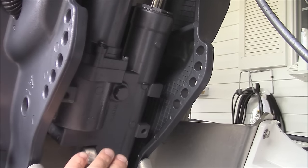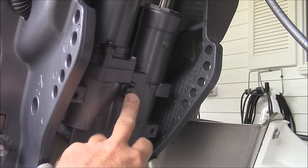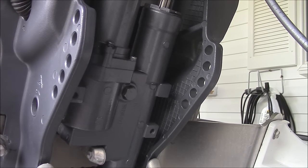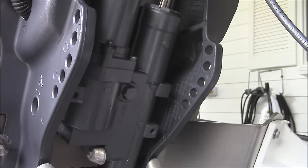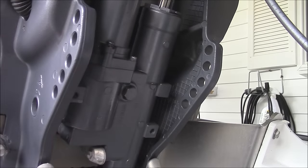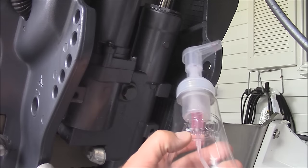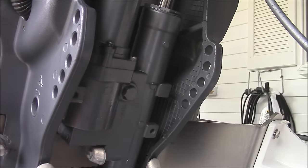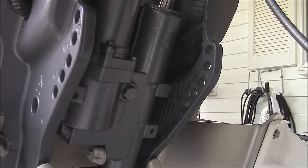Basically what was going on: you have your reservoir fill right here. This is an 18-millimeter socket or wrench. As it goes all the way up, you start to run out of fluid and it causes it to drag. So here's the tricky thing — how to fill it up and what to do. I got the Yamaha trim tilt fluid. Obviously this is at an angle because it's on a jack plate, so in order to fill it, it keeps flowing over and there's no way to get a funnel down there. So what I thought of was to take an empty hand soap bottle and put your trim tilt fluid in there. You take the nut off and put something on the floor to catch all the fluid that's spilling out.